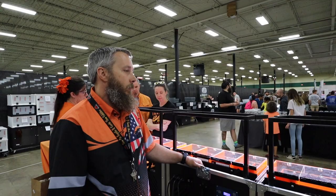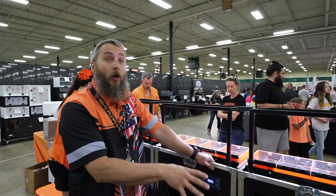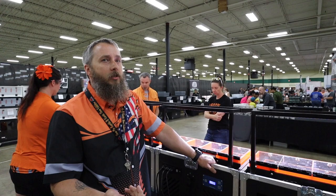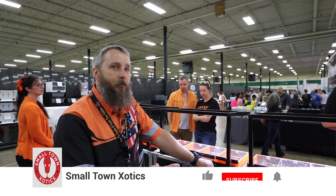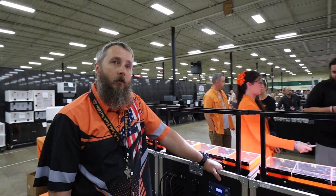What is this material made out of? It's all high-density polyethylene. When I started these, I wanted something quick to pack up and lightweight, because once you fill them with snakes, they're heavy. I tried using expanded PVC because it's lightweight, but it busted and cracked when I was assembling my prototypes, so I had to switch to something stronger. I didn't get the lightweight, but I got a durable product out of it, so I make all my products out of it now. You want them durable because they're made for traveling and bouncing around.